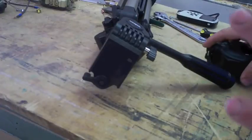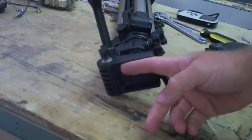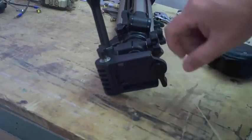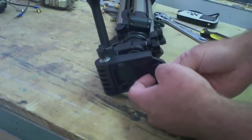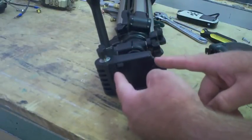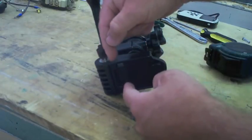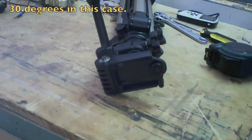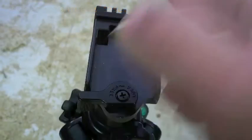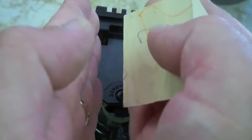You first have to study how the mounting works for these. It's like a plinth — you've got an angle on this side, and then over here on this little latch you've got that same beveled edge. So we need to take a measurement of the full dimension, how wide it is completely, and then go to the chop saw and try to fake in some of these angles until we find something that works. It also appears to have some sort of a side chamfer, so the parts clip in two different dimensions.